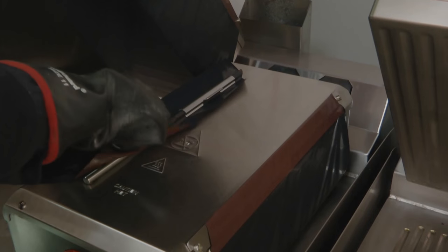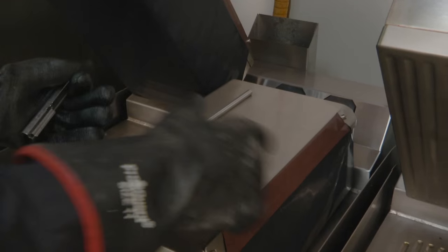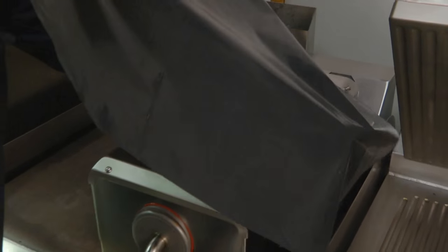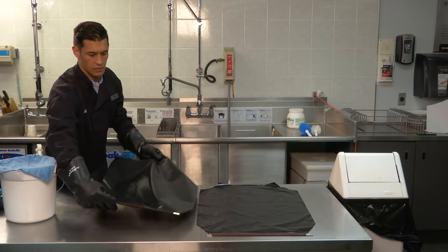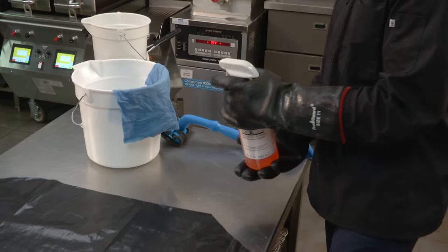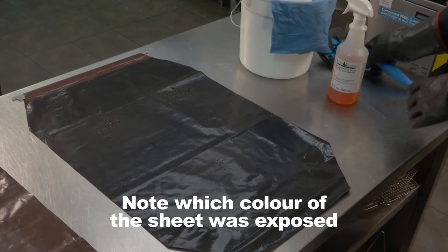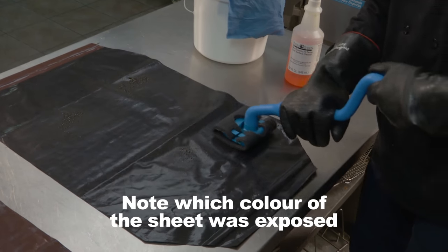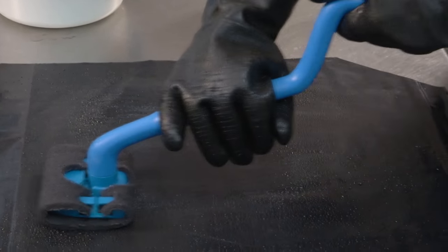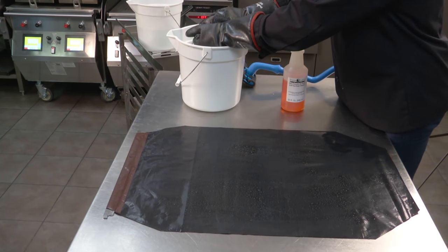Remove the Teflon sheets from the platen by removing the clips holding the release sheets on the top of the platen. Unhook the release sheet from the right side of the platen to remove the sheet completely. Take the release sheets to a flat surface and clean the sheets both front and back with grill cleaner, grill scrubber, and a wet cloth. Each side of the Teflon sheet has a different color — note which color was exposed, as when the sheets are replaced you will want to expose the other side to help extend the life of the sheets. Wipe the exposed surface of the Teflon release sheet with a clean sanitizer-soaked grill cloth. Make sure to keep the sheets flat; do not fold or crease the Teflon sheets.